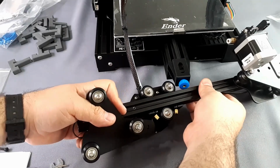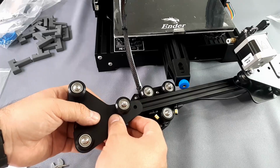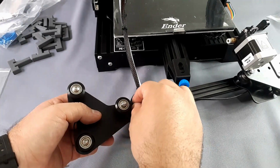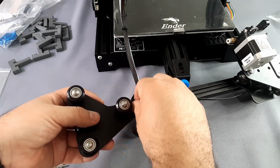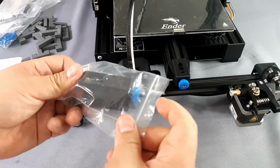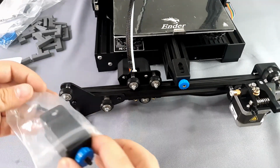The V block of Z requires two screws. As can be seen, it has a notch similar to the one on the other side. There we will place the block, which also has two screws. The manual indicates that only one be installed. Locate the X-axis tensioner. It is necessary to disassemble it.